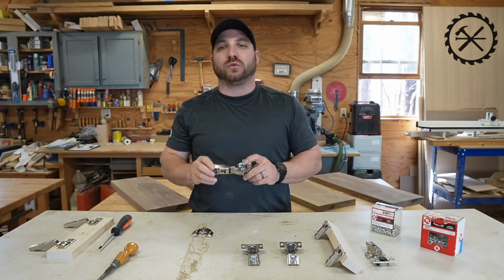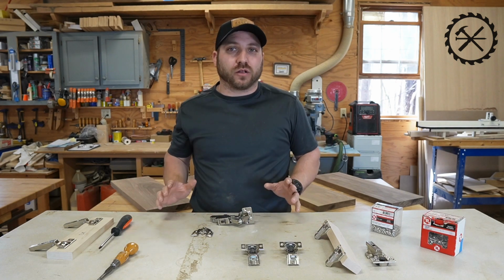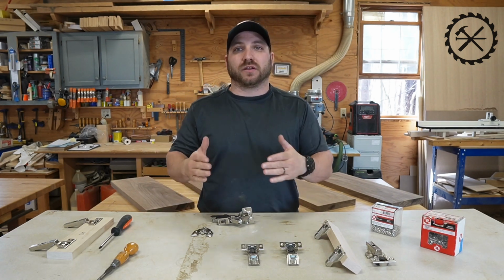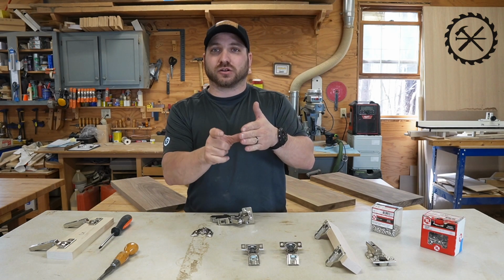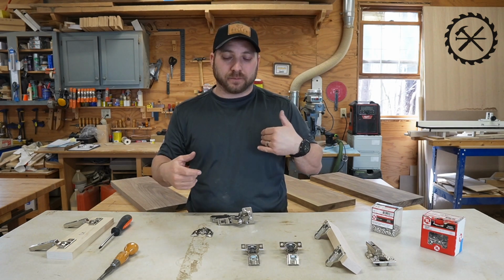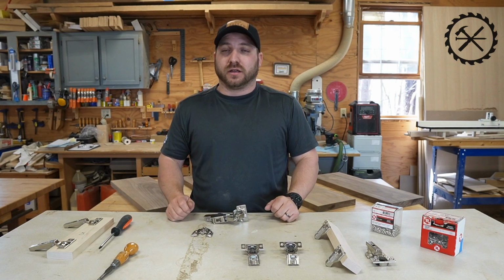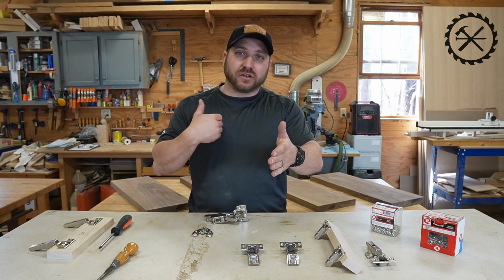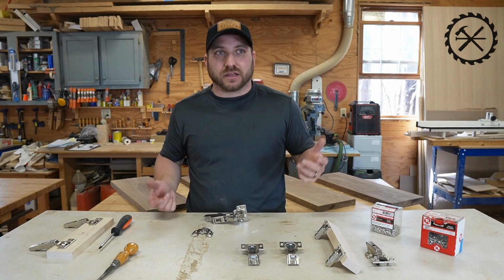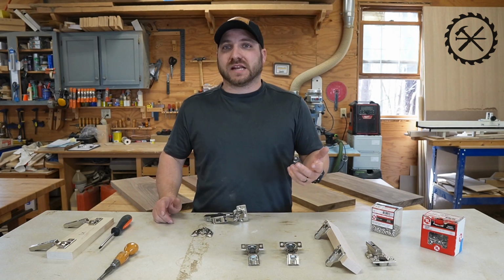These are what I would use for a Susan cabinet. Now, just about all of our Susans are made so that there's two doors. One opens first. The second door has a larger stile on it. That opens second. We don't use soft close because you'd be sitting there for 20 seconds waiting for the first one to close, and then you can close the second door. Some people could say that you could do soft close on the second one. At that point, what's the difference? The other one's not soft close.